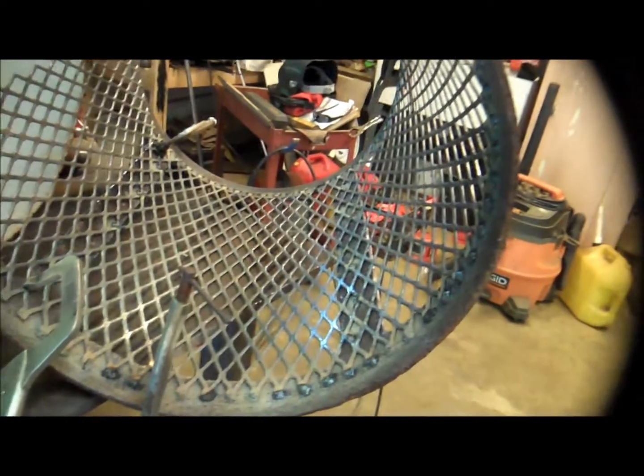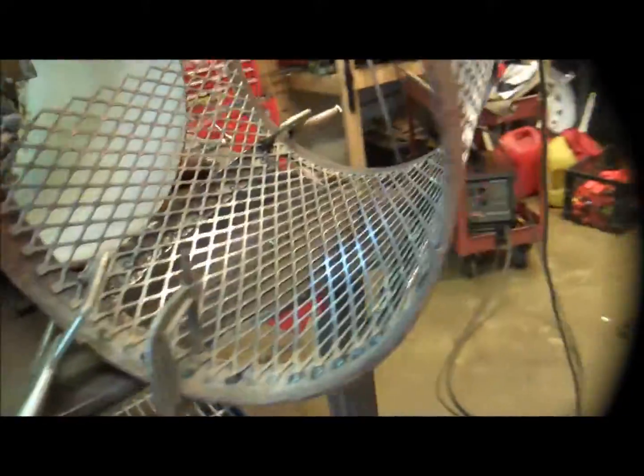Getting the screen put in the drum — just tack welding it in there. I was going to make it bolt in with some band iron to hold it, but I figured I'll just weld it. It's a 9-gauge flattened expanded metal with three-quarter inch holes. I wanted the orientation this way — this is the way that it will be spinning — instead of the other way. The other way I could have gotten a full piece in there, but I had to cut a piece and put it in.